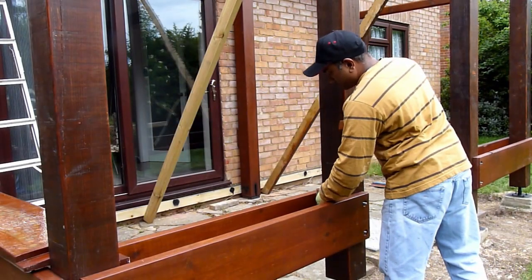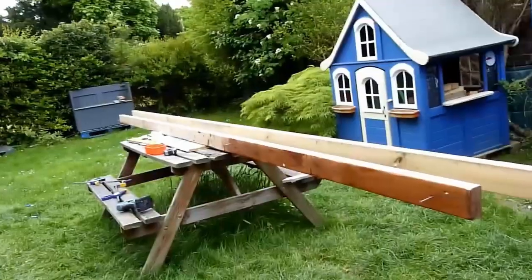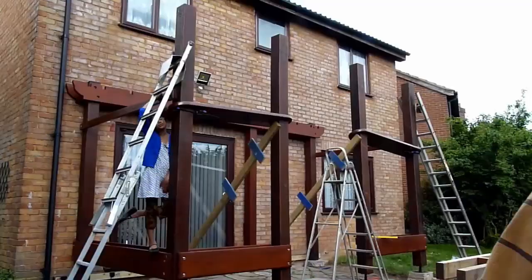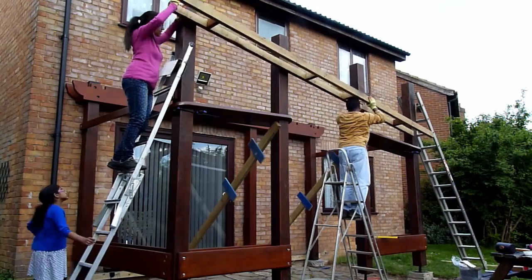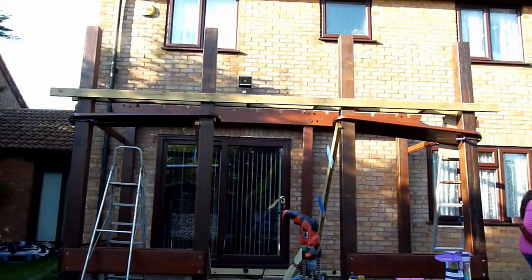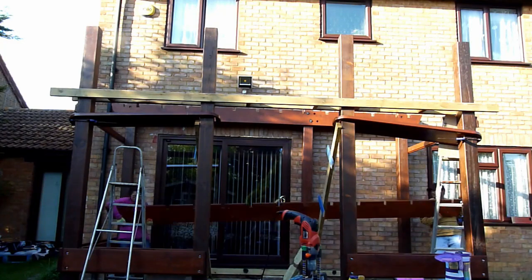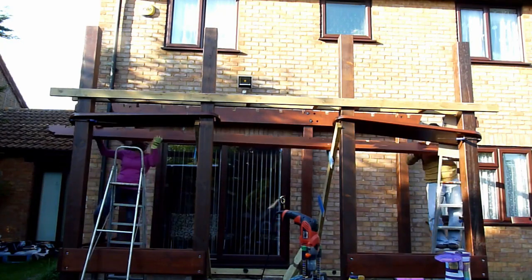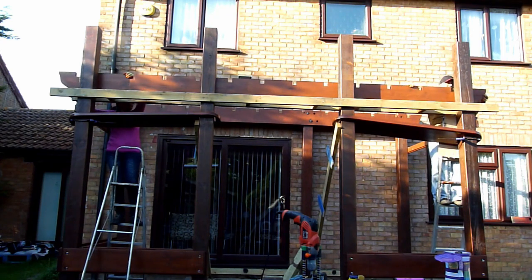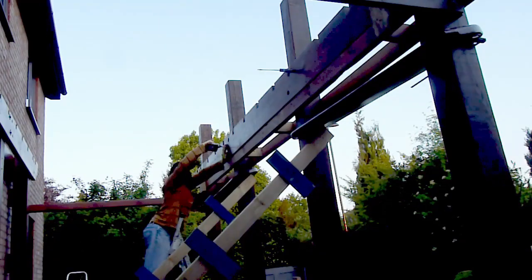For the front two girders I need to make a template out of 2x4 timber, spacing off the width of my posts to make the frame. We carried the frame across the posts, inserted it, and screwed it all in place. This is the third girder — we lifted it onto the support and used some decking screws to hold it in place.